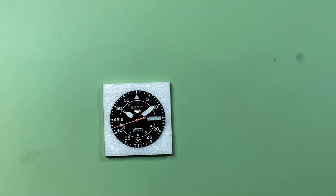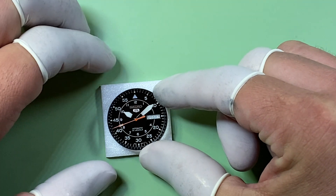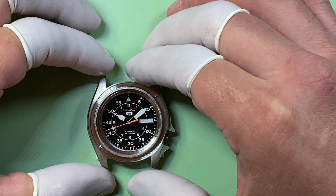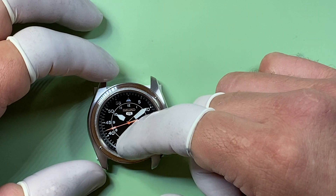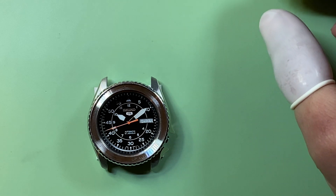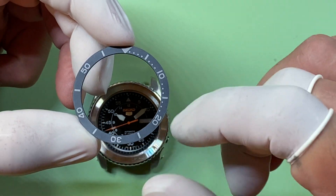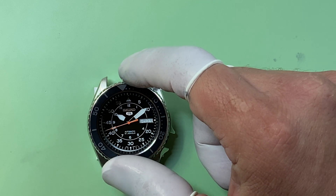So let's say we did a square tip like that — I think the square tip probably looks better than a round tip. Let's put the case over it. So now you've got that look. Let's throw a chapter ring in there. This chapter ring is silver. Put the bezel on, and then you could leave it polished, or I could bead blast it so that it's got a satin gray finish, much like what the markers and tick marks on the chapter ring look like. We could put that all together with a flat crystal and have it look like that.